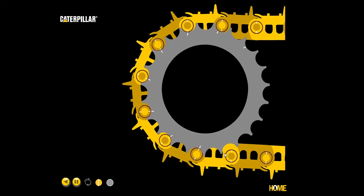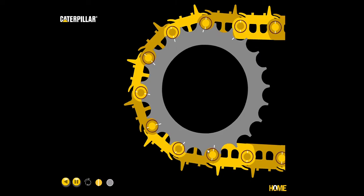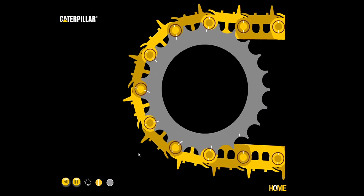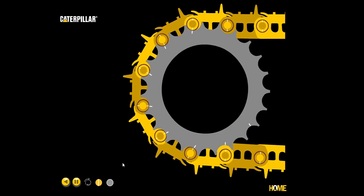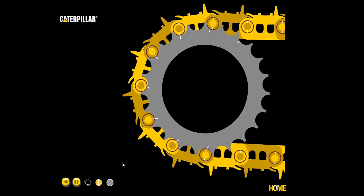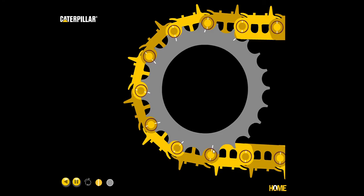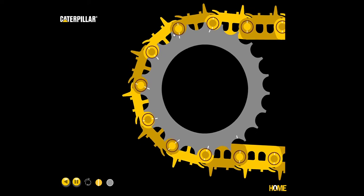I'm going to turn that off and start the animation again. The other thing they're doing here is showing a white hash mark indicating where the bushing comes in contact with the sprocket, to show us relative motion. I'm going to pause it again so you can see when they first come in contact — they're lined up and staying aligned, so there is no relative motion occurring.